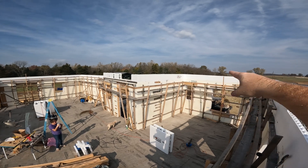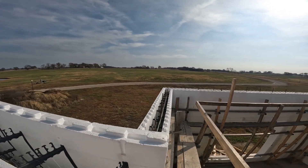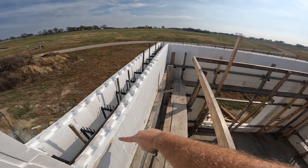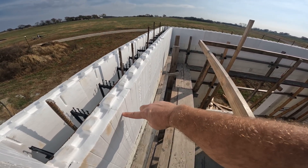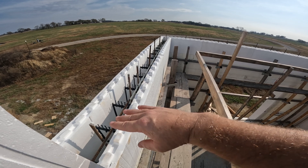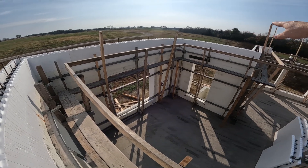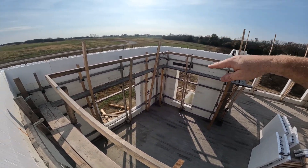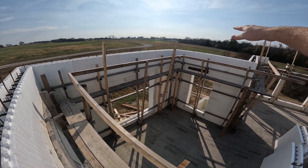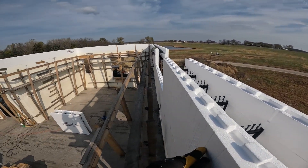There's the row that we're doing coming on around now. As mentioned, this guy right here is my office wall — it's actually stacked and it gets cut somewhere about right here at the angle that the roof pitch is, which is one-half to 12, or one-half inch for every foot. That will be cut at an angle and then go over there at the same angle. I think this is like 18 feet, so there will be nine inches of rise.